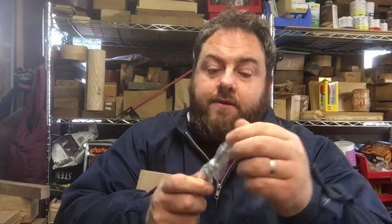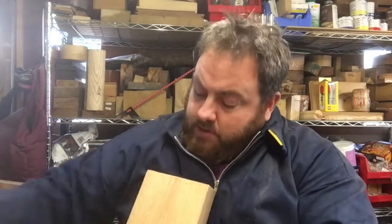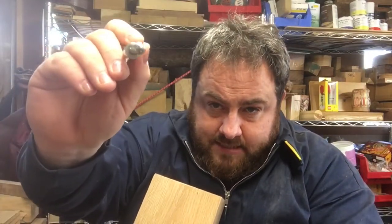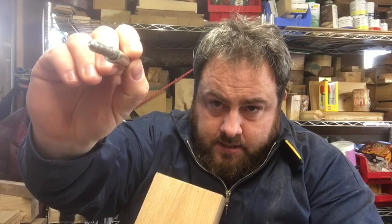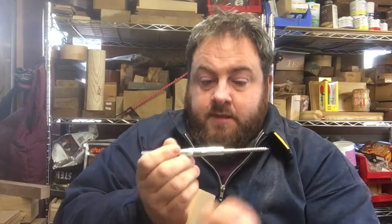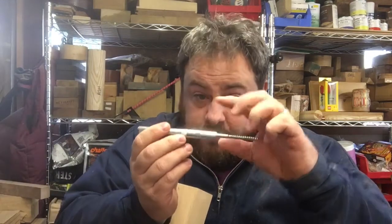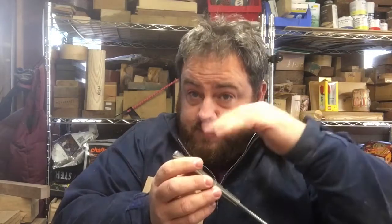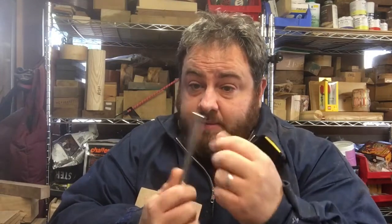Pretty difficult to see that, but if you look there, you'll see the shaft isn't completely centered, it's off center. So as you turn that, you get like 5 or 6 mil between the top and the bottom. No, probably 3 mil. Well, that's enough to level it up. So they're pretty good. I ended up having to cut the top off and grind it down to make them smooth, because the only drill bit I had was a flat bit, but it was fine, perfect.